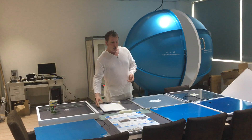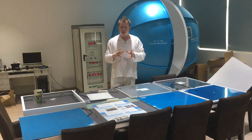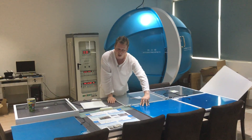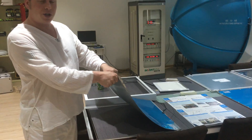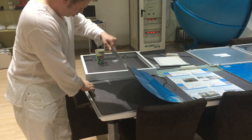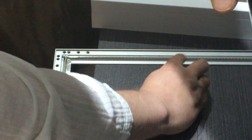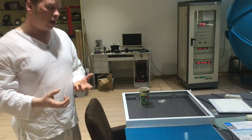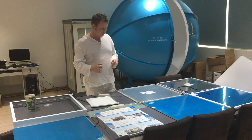What's happened in China is this whole first principle with everything has been made cheaper. We also have a cheaper model, but I'd like to explain the cheaper models available on the market. What's tended to happen is this type of panel has come along, which I call a jam sandwich. What you've basically got is a sheet steel back that's screwed down to the frame. This one uses a 4014 diode, which is a very narrow diode, and they're all spaced very close together. The heat is higher at that point — you're only using the aluminium frame for heat dissipation. With more heat on the LEDs, you're going to get quicker deterioration on your L70. L70 is where the lumen depreciation becomes 30% of its initial value.